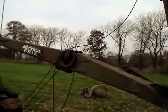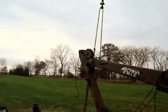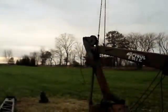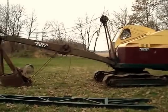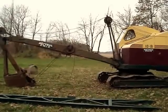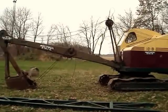The A-frame is up with the hoist cable hooked to it and now we're in the process of putting the two cables on. We just have to attach one end of the cable to the top of the backhoe and the drag cable needs to be attached to the drum inside the machine. Just to be safe we have the 22B here with the cable in place holding it up. We got the cables in place — only thing left is to fire it up and see if it works. It probably hasn't been on this machine in 20 years or more. Look for a possible instructional video on the cable backhoe next spring, and hopefully some digging videos as well. Thanks for watching.